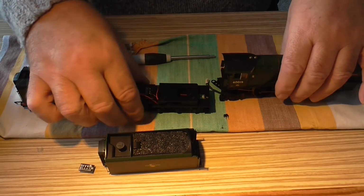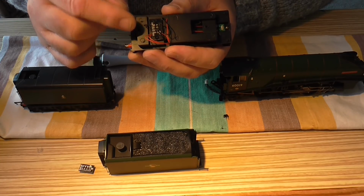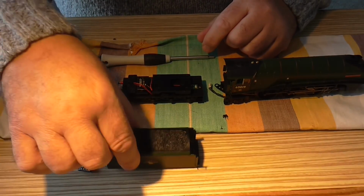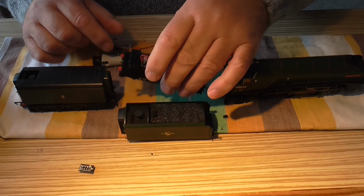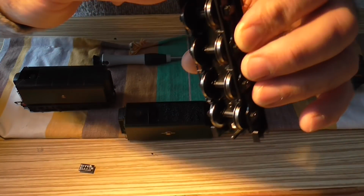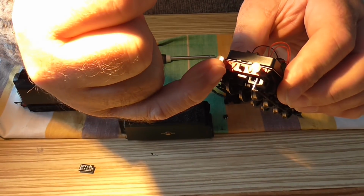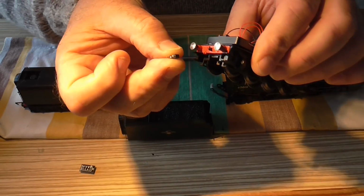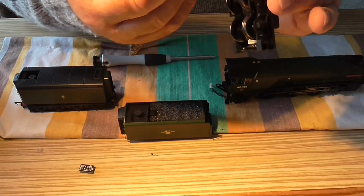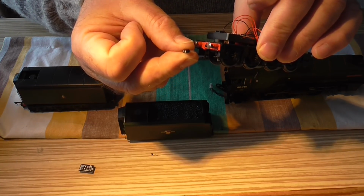So when I've done the wiring here, I solder underneath this board and pull the wires through the holes for the lights and the common return. I'll then wire them up to the plug, one of these micro plugs which I've put down, and I don't know where to put it. Then I'm going to drill down through the chassis, through a sort of loop there which you might be able to see, and the wire comes through that loop so it doesn't hang down, so it supports the wire with this male micro plug soldered onto it, so it'll come out probably about there, if it comes out clear. And my battery is just about to go again, so I'll see you in a few seconds.